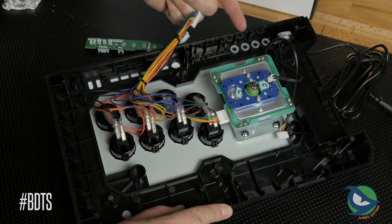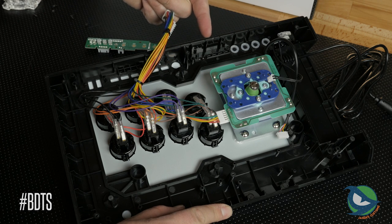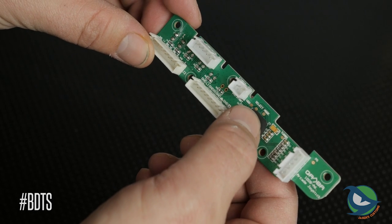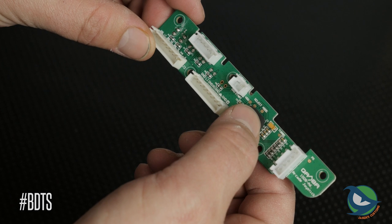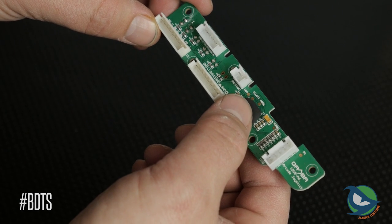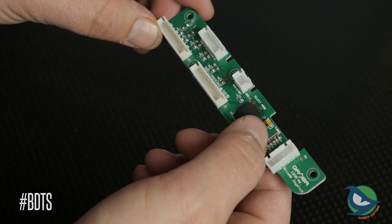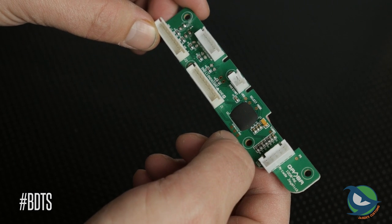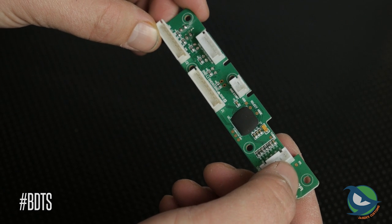As with many low cost sticks, all of the aux buttons are rubber dome style switches. Closer inspection of the PCB shows that everything is labeled, making it very mod friendly. Even the switches on the front like PS, Start, and Select have test points on the bottom of the board facing inside the case, making them accessible for advanced modding. It will require some fine soldering, but for those accustomed to doing it, this is pretty straightforward.